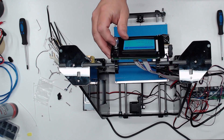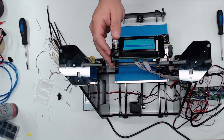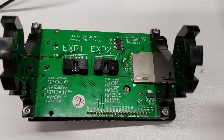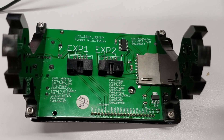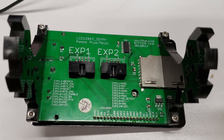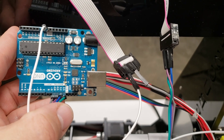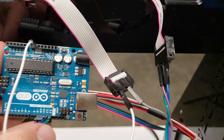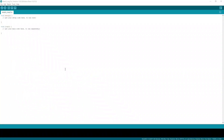The next step was to flash a bootloader and install the latest copy of Marlin. The motherboard does not contain header pins to install the bootloader, so you have to use the ribbon cables that connect to the back of the display board. This is a fairly simple process — I linked the pins you connect each one to in the description. You can see where I've got the Arduino connected to the ribbon cables using simple jumper wires.